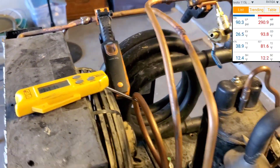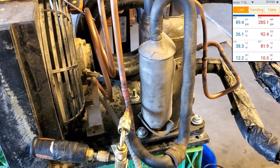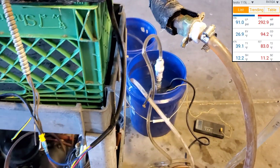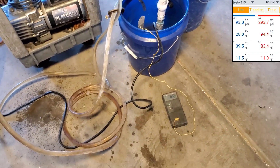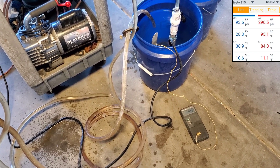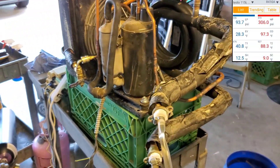It's probably about 47 degrees — 290 psi, that's like nothing. We'll see what this hits when the water temperature gets up into the 100s. As long as it's not over 500, I'm not going to sweat it. So what, we've been running five minutes? Water's went up almost 20 degrees — it's gone up 18, 19 degrees from the 65 start. Got over 300 on the high side now. Nice and quiet.